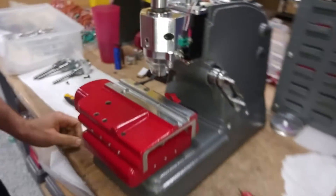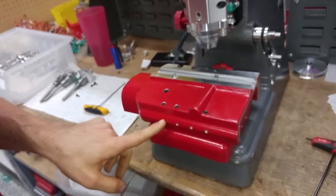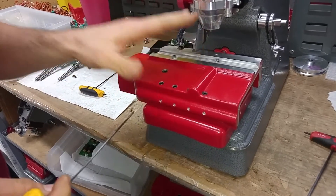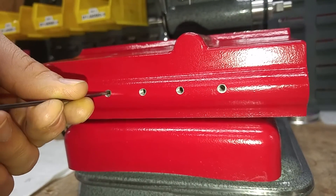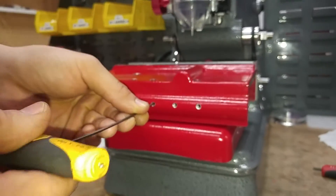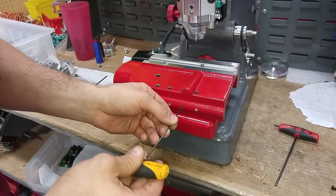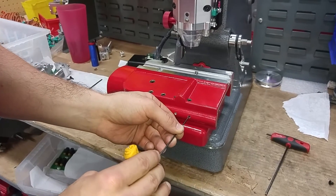Now is the important part. We're going to take a 5/64 and loosen these screws. What these screws do is put pressure on your bearings, tightening up and giving the table rigidity. We're going to do all of these about a quarter turn off — about a quarter of a turn each. Same thing here, quarter of a turn. Come to this one, quarter of a turn. This one, quarter of a turn.